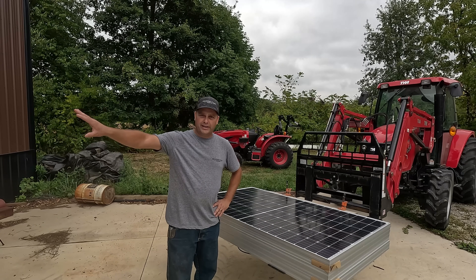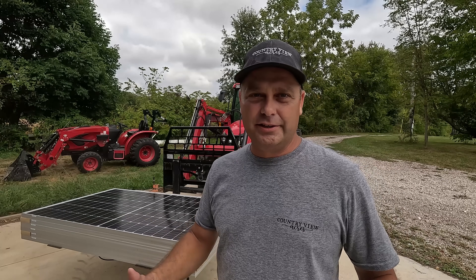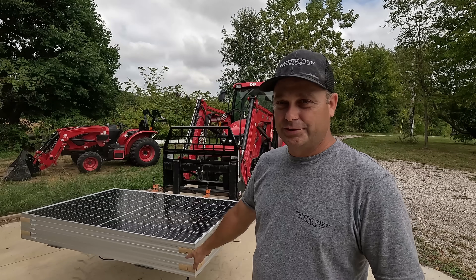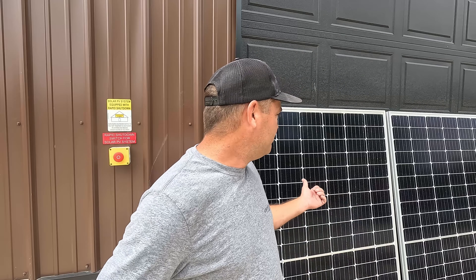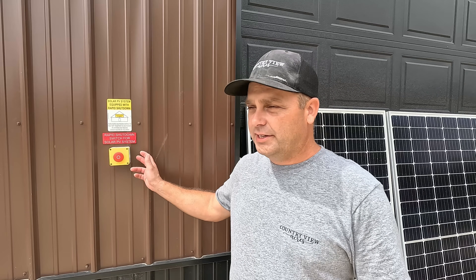It's been a week since I got the mounting system up on the roof and I've got everything pre-wired back to the solar power system, the EP Cube. All 12 panels are going in series to form one big array. When you put panels in series the voltages add up — each panel is 39.9 volts, so 12 together gives 479 volts DC open circuit. That's fine because the EP Cube goes up to a maximum of 600 volts. I also have rapid shutdown modules that install onto each panel and work with the e-stop button, so in an emergency or fire, hitting e-stop drops the voltage to a safe level.